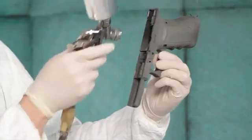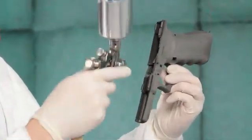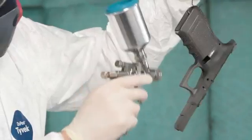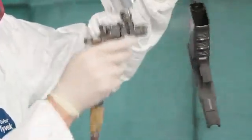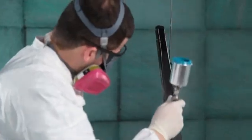When spraying, strive for even coverage. You're seeking a 0.5 to 1/1000th coating thickness. Spray with sufficient volume so that the CERAKOTE does not dry spray, which is when the coating dries in the air before reaching the part. When spraying, the part should appear wet, but not so wet that it wants to run.